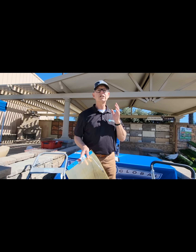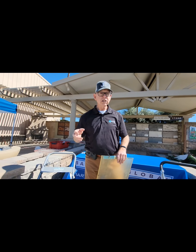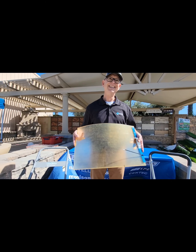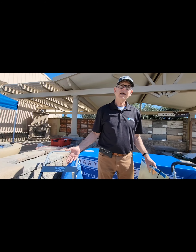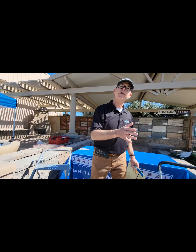You still run some risk of cracking or chipping, and it's also sliding rather than rolling, so there's still minimal risk of scratching. The biggest problem is they lose the mat or forget to put it on. We see that all the time — sometimes they use carpet underneath, or maybe some cardboard, or plywood. It's likely to scratch, and the one time it scratches, chips, or cracks and that customer doesn't want to pay, now we have a problem. You've got to switch out the damaged pavers.